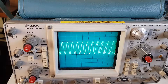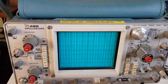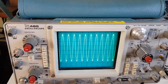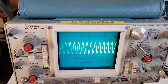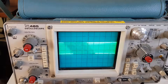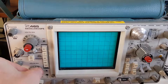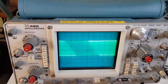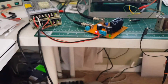We got a sine wave there at about a kilohertz or so. The max amplitude of this thing I can get pretty high — a pretty high voltage on that secondary if I really wanted to. The beauty of this is now I can sweep the frequency around. I can use this to find the resonant frequency of the transformer. I might be exceeding the voltage limit of my scope probe, but you get the point.